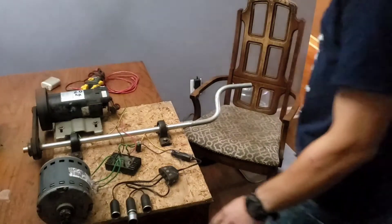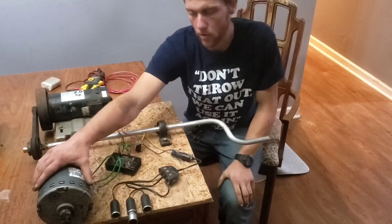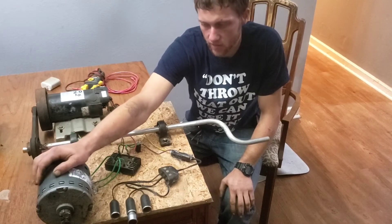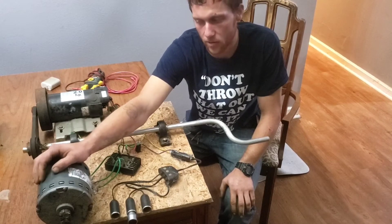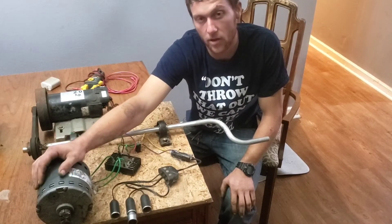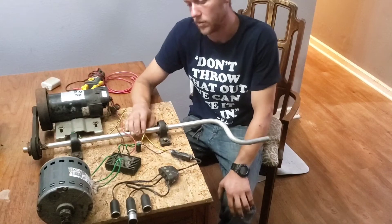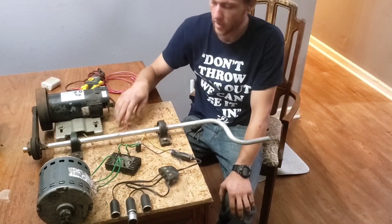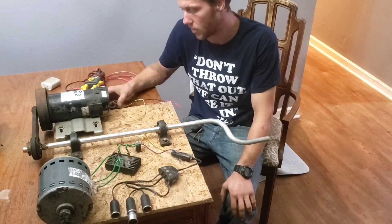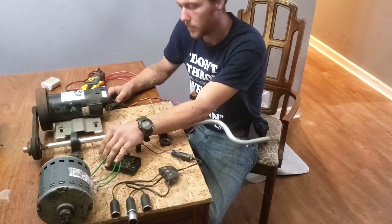These three-phase motors — this is an ECM 3.0 one-horsepower HVAC motor, a three-phase brushless motor that they put inside HVAC units for efficiency and variable speed. I have other videos on them in my channel, including how you can get these motors dirt cheap. They are very readily available at your local scrapyard — you just have to find one that will sell to you, which I found difficult in Florida but had no problem in Georgia. The three-phase setup is definitely a lot better.